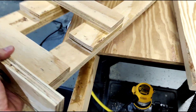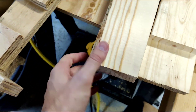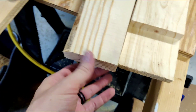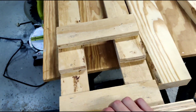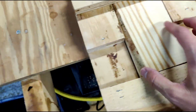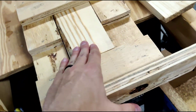This is my little jig made out of roughly three-quarters inch plywood. Since a two by four is one and a half inches thick, three-quarters is one half of that, so it's an easy way to more evenly create a half lap joint. I'm going to be taking a two by four end and routing it into a smooth 90-degree half lap joint. You stick the jig over your two by four, the end hits a stop here, and I've got two fences — one on each side — creating the cutting zone.